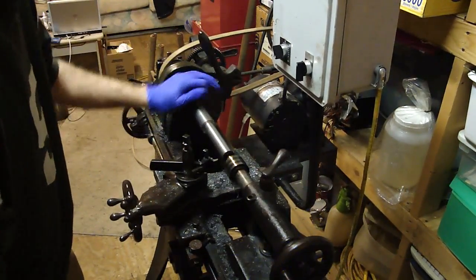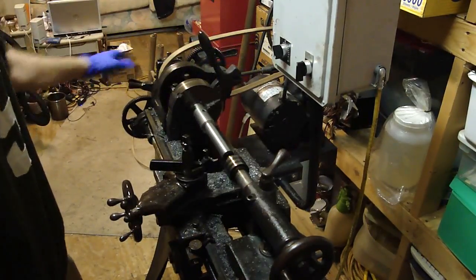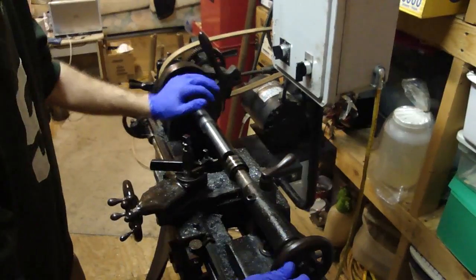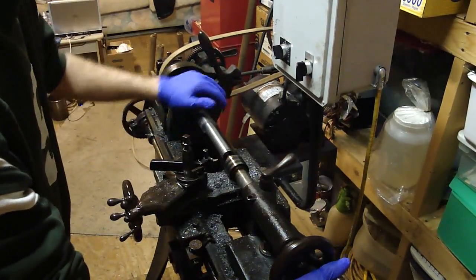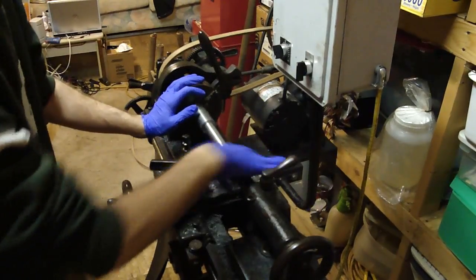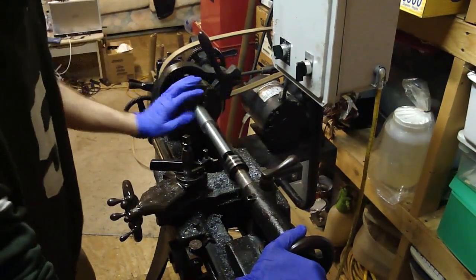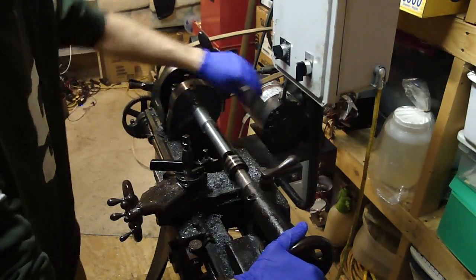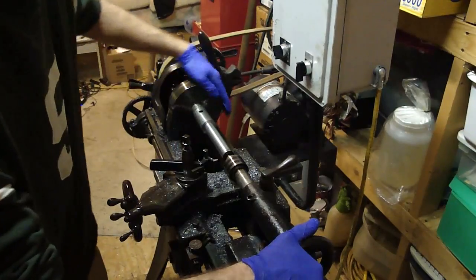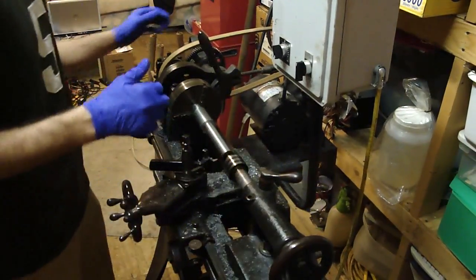No pressure, and I've got free movement while I'm driving the gears, so it's not totally free. This is a live center - you can see it's not horrible, but there's some kind of thrust bearing on it or something that can handle this load, because it stops spinning as soon as you put a little bit of pressure. That's as much as I can have and not feel like I'm straining the machine.